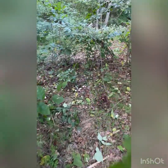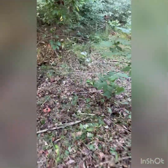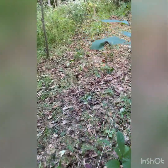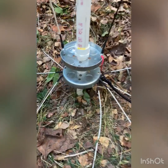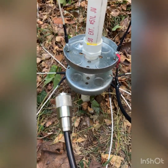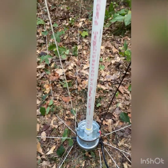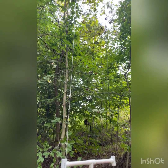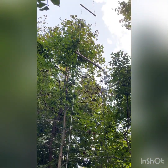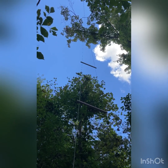We're heading into where we put this vertical antenna up. You can see on the ground there's some radial wires — there's eight of them total, four that are 16 foot and four that are 32 foot. They all come into this center section here. You can see the coax, the positive on the top plate, negative on the bottom plate, and then it comes up into the radiating elements that go way up there — 32 feet to the top where it's tied off up in that tree limb.